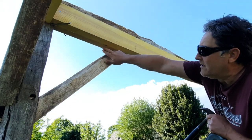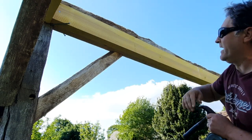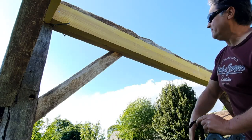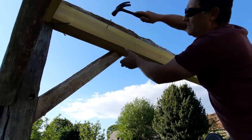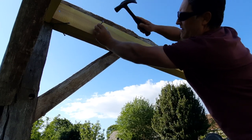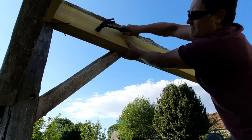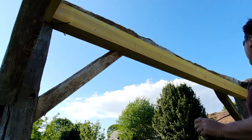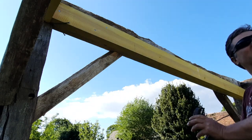In this area I've doubled up — there's two lengths of 6x2 there to support this beam, so now I'm just going to pin the two together. In effect it's like a 6x4 beam going through there. Fix them at the diagonal, go in slightly at an angle, one offset at a different angle — you have a very good fixing then, a lot of strength in those two. Without further ado, let's get the floor done today.